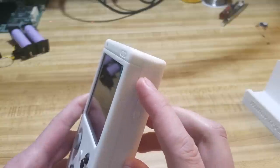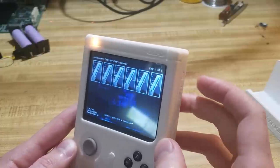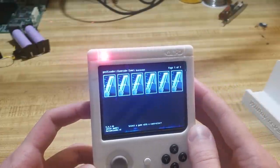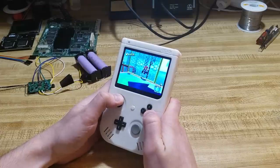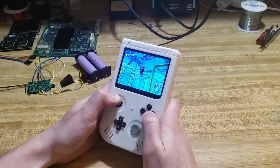The Wii Boy is powered on and off by holding the power switch for one second. Tapping the switch changes the multi-function RGB LED between modes: off, RGB slow fade, battery level indicator, and shipping mode. When the battery is low, the function automatically changes to the battery monitor to warn you to charge the device. When the device is powered down in shipping mode, it cannot be turned on again until you plug in the charger, preventing it from discharging in a box.